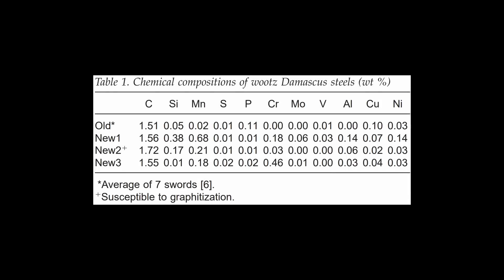The steel has high carbon and is processed by cycling at relatively low temperature to get the carbides to form in bands, which create a laminated structure giving a pattern similar to pattern welded Damascus but in a totally different way. Juha was interested in whether wootz is the true steel of legends — does it do things modern steel cannot? He did an initial study recreating the material and found he could do so with a chromium addition. Dr. Verhoeven and Al Pendray, famous for their wootz studies, found a tiny amount of vanadium in historical material, and Juha developed his method using chromium and sometimes a small vanadium addition as well.